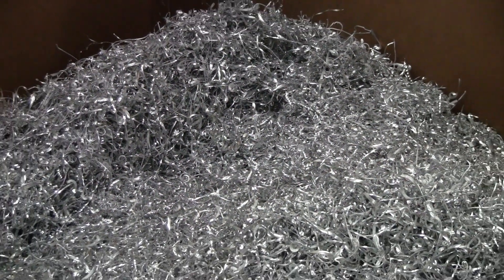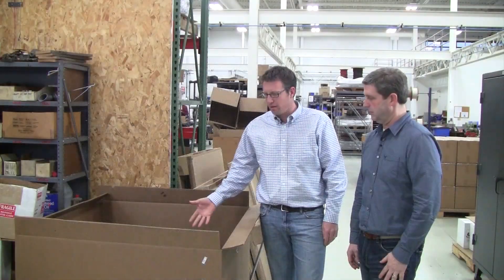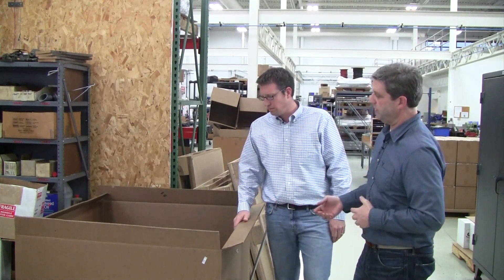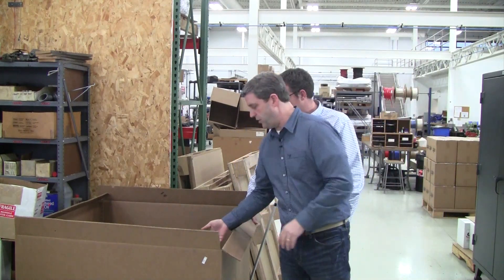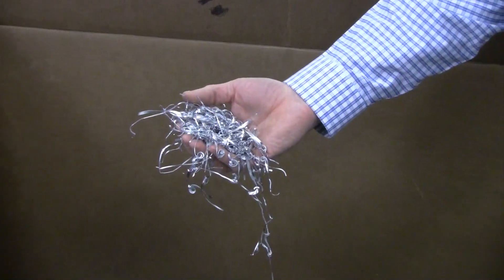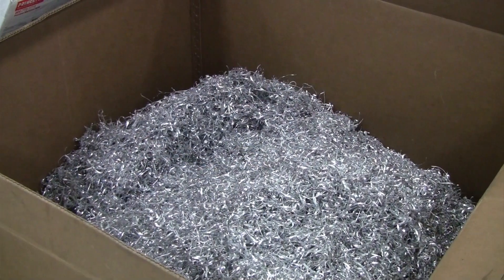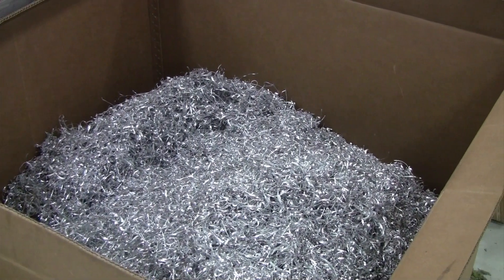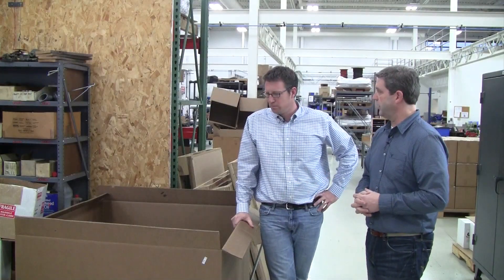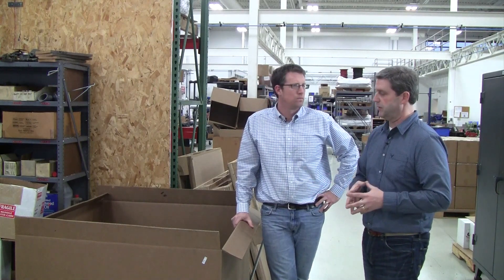So, Larry, not only is MQL neater when you're cutting, but I can see that after that's done and you've got all of this waste, it's cleaner and neater as well. Well, cleaner and neater, but also it's going to save you money because when you get these chips into a recycler, they're going to like that better — you're going to get better scrap value. Some recyclers have told us that with coolant, they will deduct like 20% of the weight because of the coolant. So there are huge advantages to using Unist Cool Lube in an MQL process, especially in machining things like aluminum.